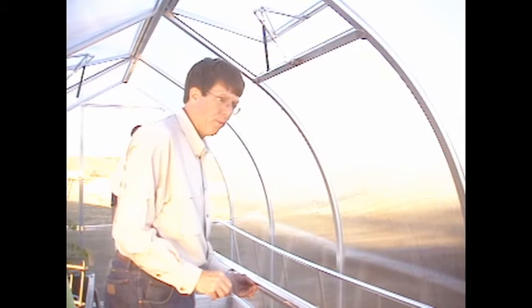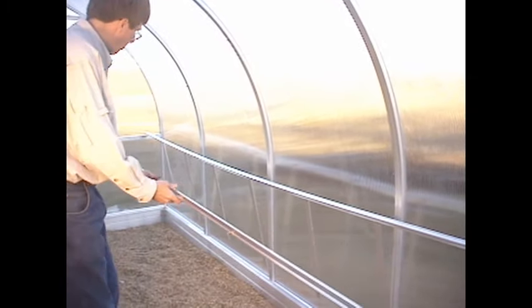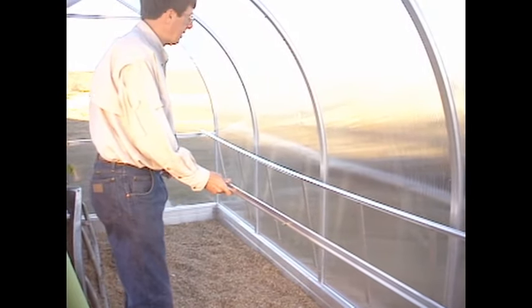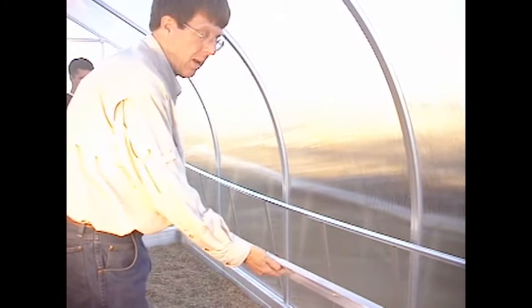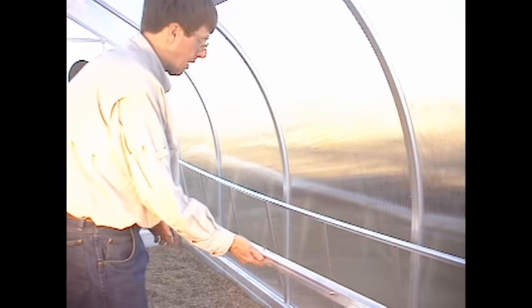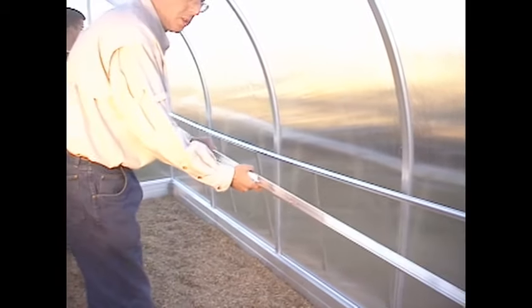Next, we're getting the front support bar of the shelf ready as well. So on the L is another L bracket with no holes in it. It will sit like this, but depending on the length of your greenhouse, it needs the same number of bolts in the front of the L bracket as you have curved uprights, because this will support with a chain from the upright. Underneath, you will need as many bolts evenly spaced as you have shelf supports, as we did on the back. These need to be attached to the front. But you also need one extra bolt at each end for a little bracket that holds the shelf lateral support in place. So we have put all these in there. I'm going to lay it down. And now we can take the front and the back, and we can tighten down all these supports.